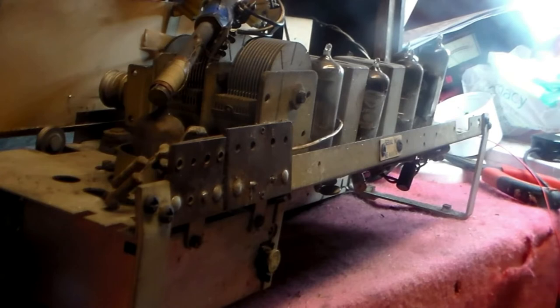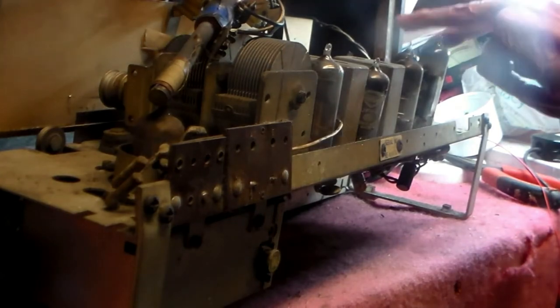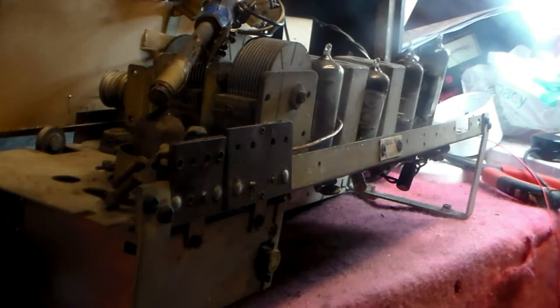Also, next, first one along is the rectifier. That converts AC to DC. It's a half wave on this, a simple diode, and on AC, it'll work either way around, obviously, which is why these cables can be interesting if it's set up wrong. On DC, of course, it'll work one way around but not the other. Okay, but most sets now use AC.